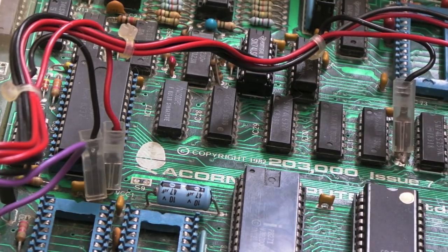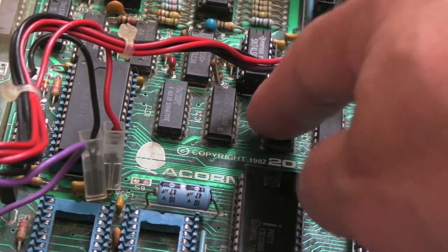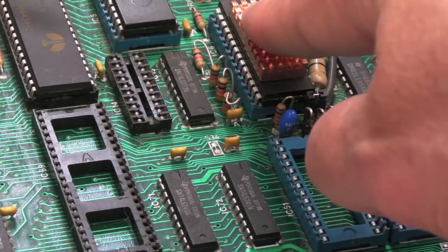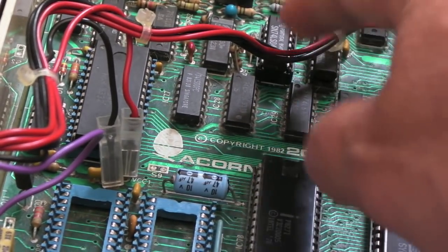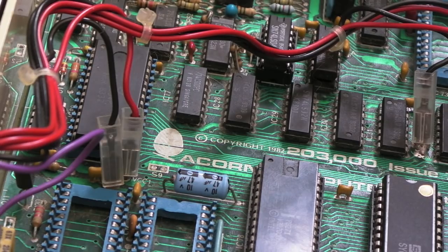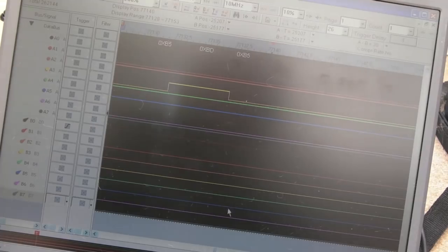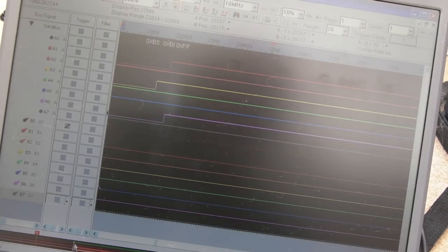On the CPU pin it's just high. So we've got a faulty 74LS32 as well — bizarre. It could have been faulty all along. I suspect if I left it on for a bit it might kick into life. The other clocks are coming out of here okay. There could also be a problem with one of the 74LS74s, which are also part of the clock circuit.